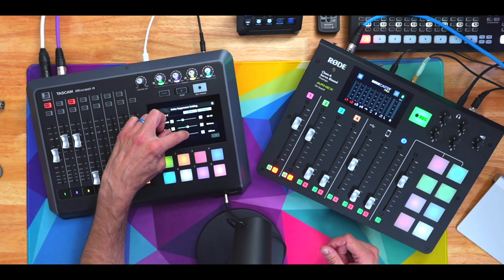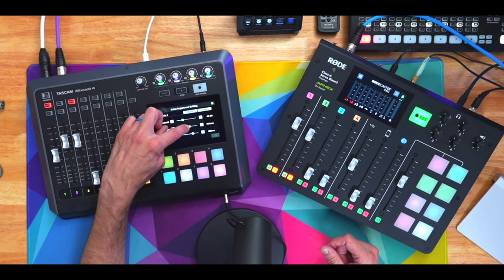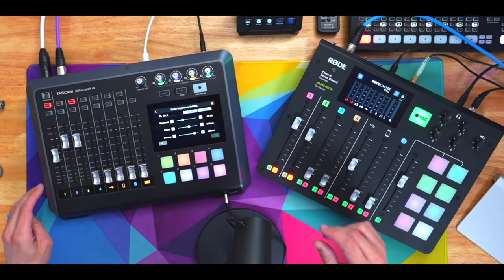how aggressive is this? There, that's not super aggressive. Let's see, attack. Okay, you can hear, this is how you can tell now how much noise there is in the gain of the Tascam. So as I'm talking, behind my voice, you can hear gain, but when I stop talking, it's gonna close the noise gate and you're gonna hear a silent signal. And you can hear it opening and closing the noise gate.